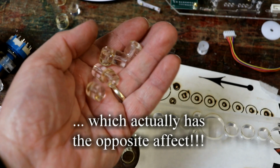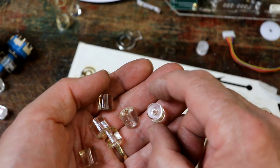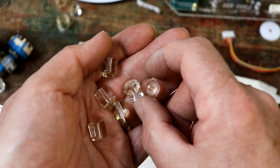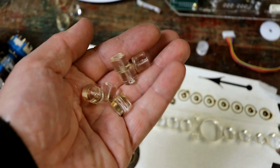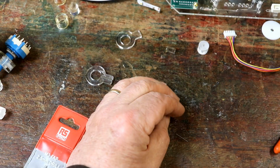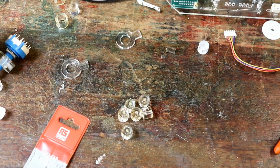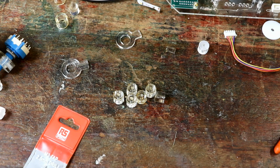Don't be too clever. Because when I'd first got the laser cutter, I didn't have all these wonderful ideas, so I just put things on and it cut them perfectly, and it has cut these perfectly. Well, live and learn, dear friends, live and learn. Stop being clever and just do single cuts, because then the acrylic is heated up once and cooled down once and doesn't have to go through all sorts of cooling and distorting cycles. Fascinating. Right, I'll get these tapped.